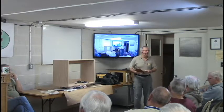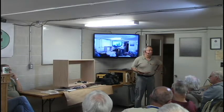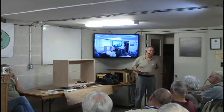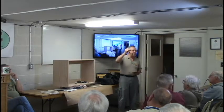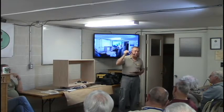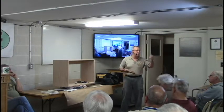Lee Valley sells all kinds of things and they have different sizes for different drills. This here is a self-centering drill bit — it's a tapered drill bit as opposed to just a straight drill bit. When you put your screw in, especially if you're doing end drills like this, you have to have a pre-drilled hole — if not, you're going to end up splitting the wood and making it swell. So it's well worth having these, and here are the plugs that I use.